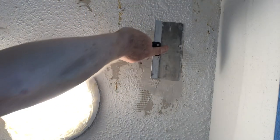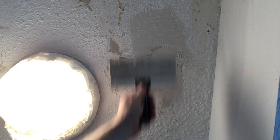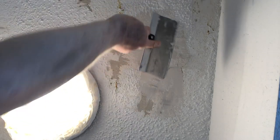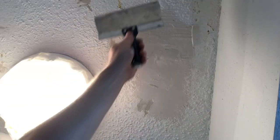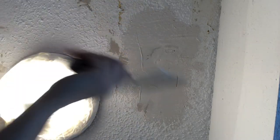Now it's gripping — why is that? Because it's soft enough to grip into those little checkered boxes on my fiberglass mesh tape. I made it soft enough. And now, because I have five-minute mud, it's doing a nice job. Let's leave that for a moment and join me over here.